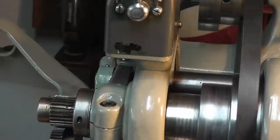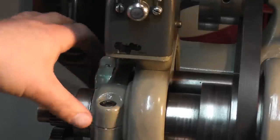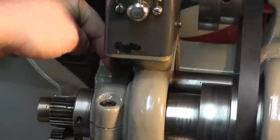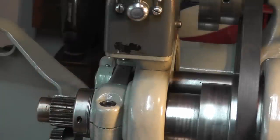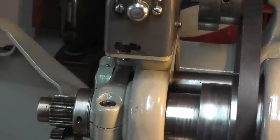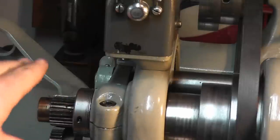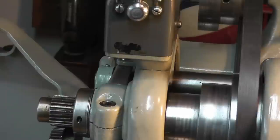The other type of bearings that were used were bronze bearings. Now the bronze bearings, they have two screws that hold down a cap that is removable. Perfectly vertical. There's a screw hole here and a screw hole here that hold down a cap. Both bearings are adjusted the same, but the bronze bearings have a little bit tighter tolerance. The bearing clearance for the cast iron bearings is 1 to 2 thousandths of an inch. The bronze bearings, I believe, are like 7 ten-thousandths of an inch to like a thousandth of an inch, if I remember right. Those are the specs from South Bend.